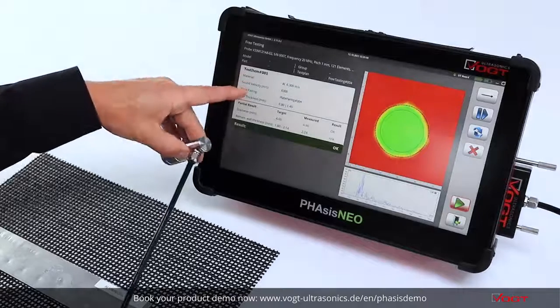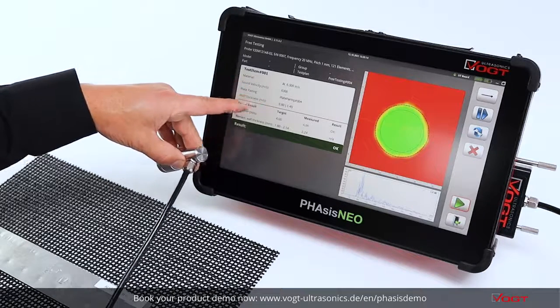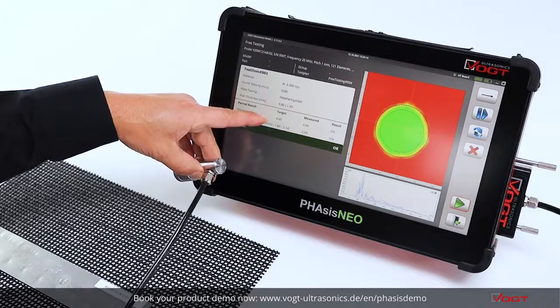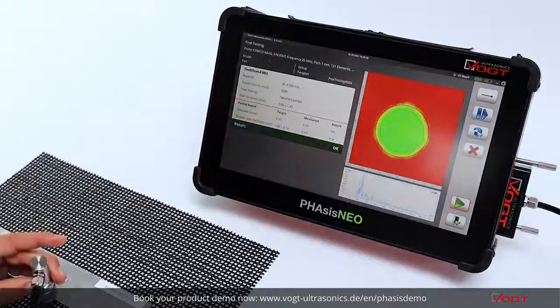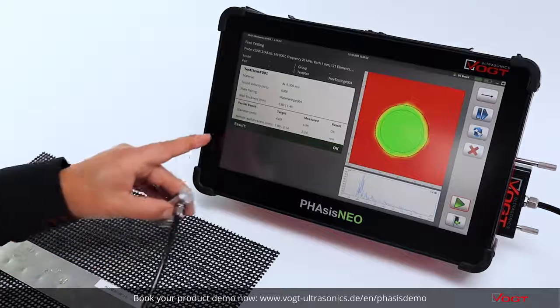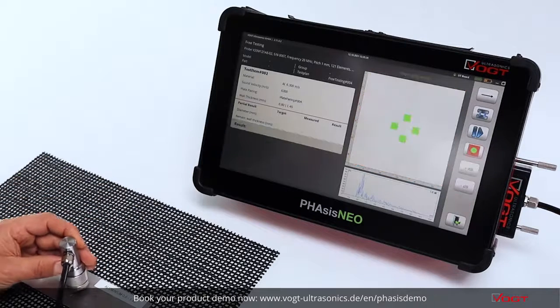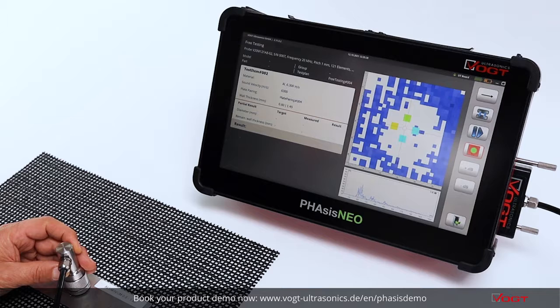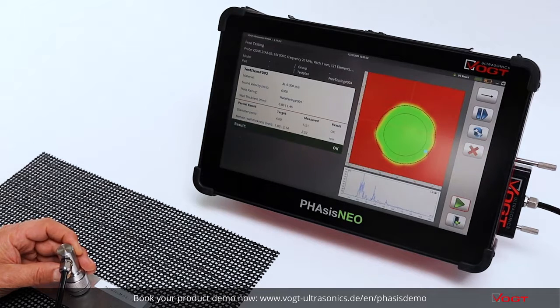Again, you see what we entered in the definitions before. Plate combination, you should reach a target diameter of 4 millimeter. The software measured 4.96, means it's bigger. Total result is okay. So if you like, you can jump to the next, do the same, trying to be perpendicular like that, background is blue, pressing the button for saving the result, right, this is okay.